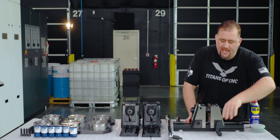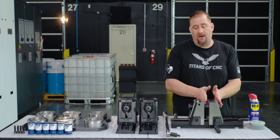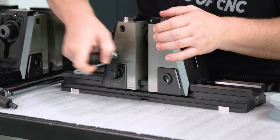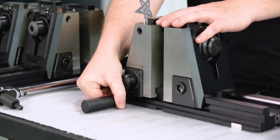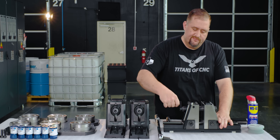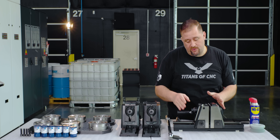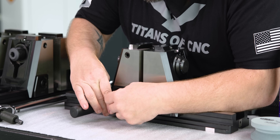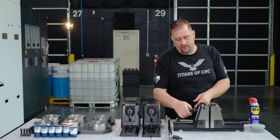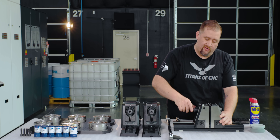If we lock this bolt down, our jaws don't slide around on the rail anymore — so now our fixed jaw is fixed. In standard clamping mode, the floating jaw can move forward and backward on the rails just like a normal vice. But in precision clamping mode, you'll notice that only this little section of the jaw moves forward and backward instead of the whole tower.